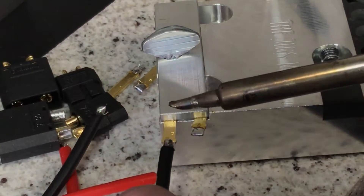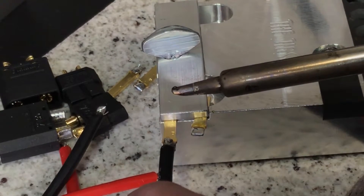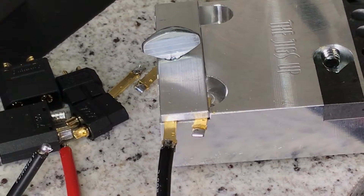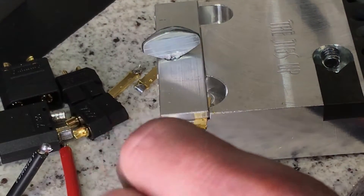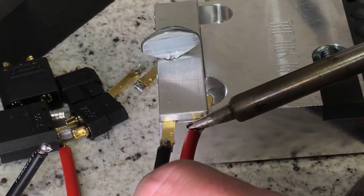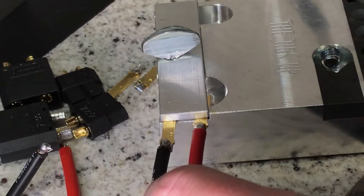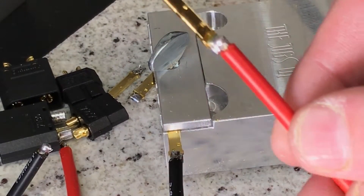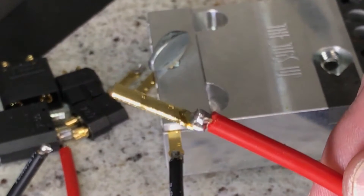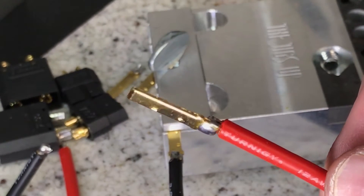Using the least amount possible and getting the most direct connection between the raw wire and the connector is always optimum. I just cleaned my tip, did a fresh tin, and I'm heating the wire to melt it to the connector. You want to touch the wire, let the wire heat and melt the solder below. Solder will go towards heat, so any additional solder will pull towards the wire and the connection. This does not take very long — just the tinning of the wire, the tinning of the connector, and a little bit on the soldering tip to transfer heat gives a nice solid oxygen-free connection.